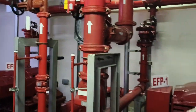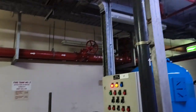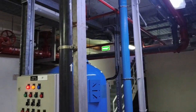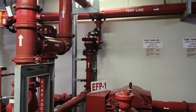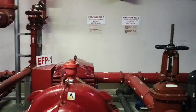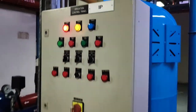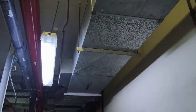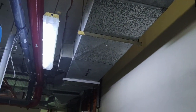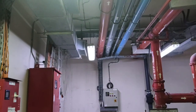Manually means it has to run until somebody comes to put it off — this is the requirement in our local jurisdiction. Every pump room has to be well ventilated with lights, exit lights, and different power supplies not directly interconnected. You can see there is also a domestic pump and an irrigation pump here, and all must have separate power supplies. This fresh air fan is the supply and this exhaust fan is the return.